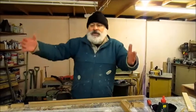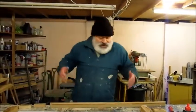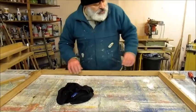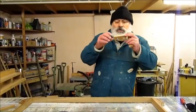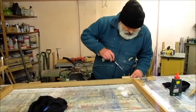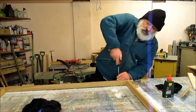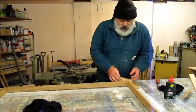Cut the mitres and got them to exactly the right length. Here's a trick from old carpenters — you don't need fancy clamps, all you need is these: just a block of wood cut at a wedge with two holes in it, which you screw to the bench. Just screw it down — it takes a bit of fuss setting them all up, but you want it absolutely perfectly square. That's just a wedge that pushes the piece in.